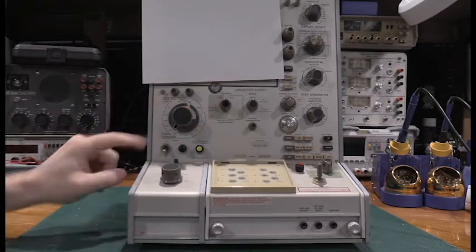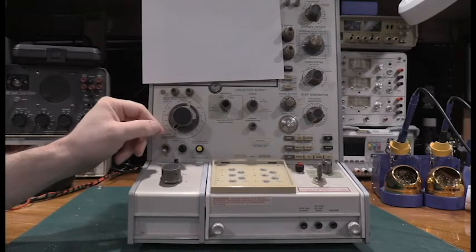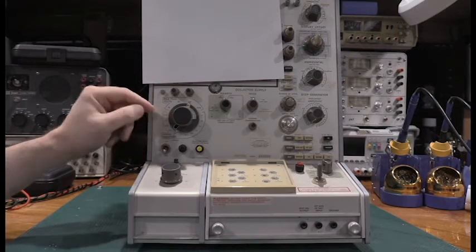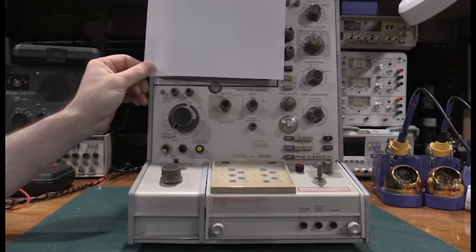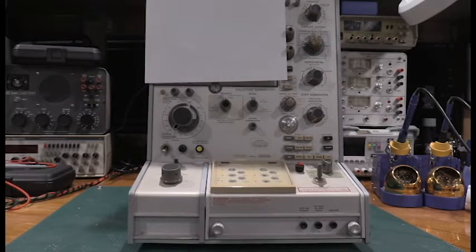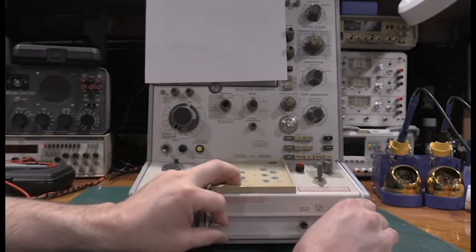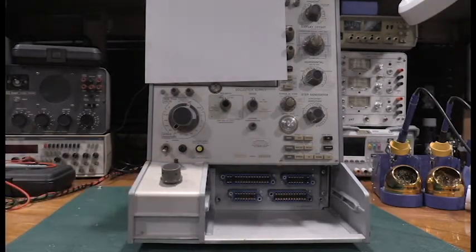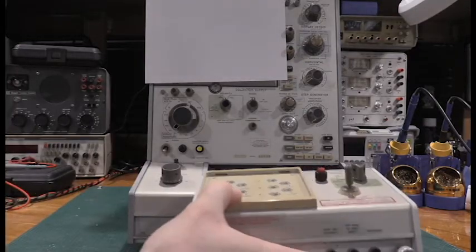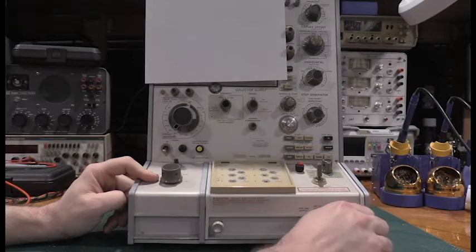This is a two-stage control. When it's in like this, you can adjust the collector voltage, and it's moving just fine and lined up. But you can pull it out and adjust a series resistor for the given voltage — so I can set it to 350 volts and limit it to half a watt by putting in a series resistor in the correct position. If this control internally cracks, it can be a nightmare to source a new one. The unit I had that was stored in a garage — this got destroyed by the sun. Readout illumination and graticule illumination worked okay; they're tied directly to a pot behind the panel. Cleaned up the front porch — these test fixtures are actually removable. This is the standard test fixture; I'm looking for one of the pulsed high current ones, but they just snap in. This is also where the calibrator goes.